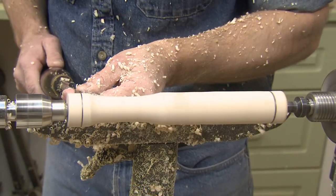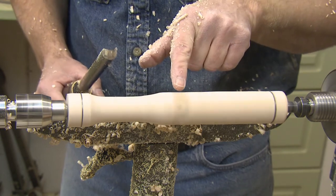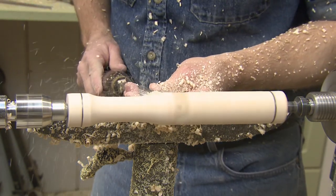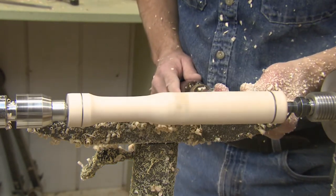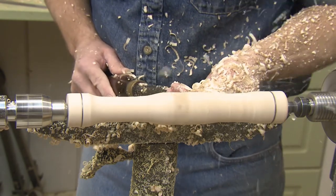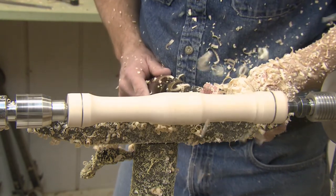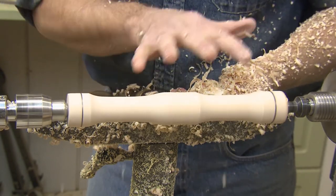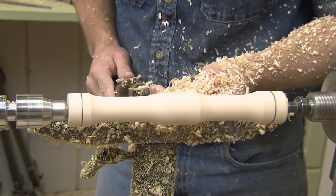Now we're working on the handle. This is a nine inch long piece of one and a half inch square wood. We rounded it down to one and a quarter inches in this area. With this hole rotating around here, be very careful — don't touch it with your fingers, and when you're sanding, go over it lightly because that would hurt if you got your finger caught in that. I'm now reducing this down to about an inch in diameter because we're going to have little bitty hands holding this, and they won't be able to reach around that inch and a quarter thickness. Once I have it shaped I'll sand it, make some nice little knobby ends, and take it over to the bandsaw to trim off the excess wood.